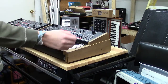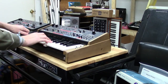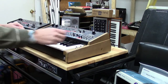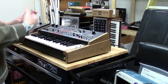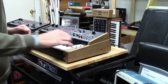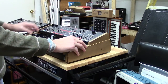You get something like that and you can go really deep with it. That's your modulation of your polyphonic section - no wave shaping, it's just a simple square wave. It would take a lot more work to get a full waveform because it actually doesn't have a key-on circuit, it's just a note on/off. But when we bring the amount control we can actually pan between the two LFOs.